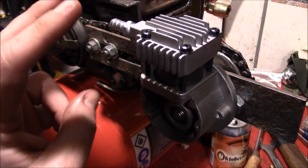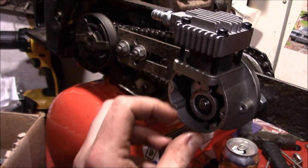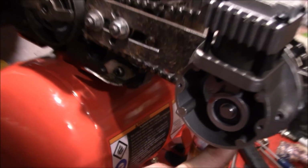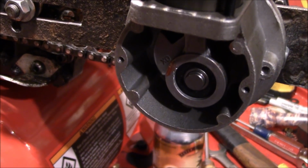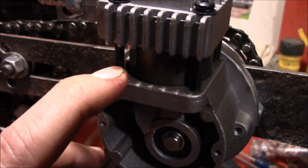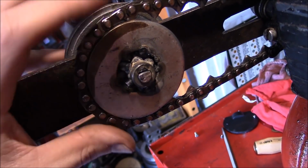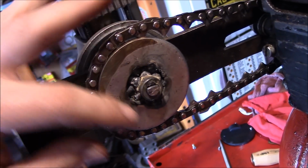Even though this is an oil-free compressor, it still had grease on all the walls. So we're going to cover up this thing here with the supplied plate that was on there. And there's a little intake hole down at the bottom where the air comes in. I'm sure we'll give that a hit of WD-40 or some oil every so often, try and make this thing last a little while longer. So we put a few more tack welds around on here and got the flat on the drive shaft to help, when that set screw strips out, we'll have something else here to keep this from spinning on there.